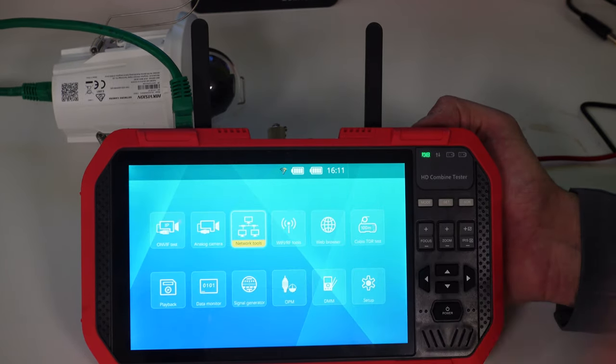The Wi-Fi RF tool is a spectrum analysis tool — you can see it's already doing spectrum analysis, showing the different Wi-Fi units and where they sit within the channels — frequencies and channel numbers. I can freeze that chart and move the scale left and right. It supports both 2.4 GHz and 5 GHz, and I can change the horizontal scan range and center frequency. It's a nice test tool in its own right.